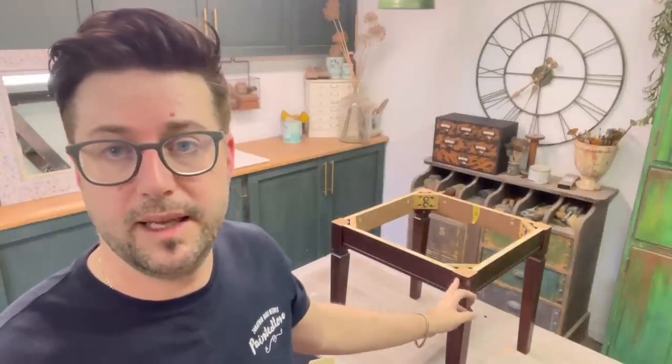that did make light work of all of the sanding. Of course you can hand sand. The reason that I went in with hand sanding was because I was a little bit worried about coming down to what lied beneath, i.e. the dark colour underneath of the piece of furniture. But if there's plenty of flakes sitting in that paint surface, then the mouse sander should just hit the high ground and take off all of those lovely chippets of paint rather than underneath. And then just go back and refine with an Annie Sloan sanding pad and everything will come out beautifully.